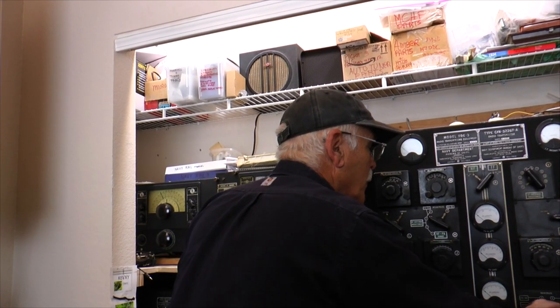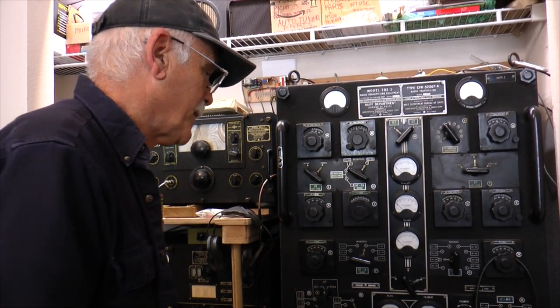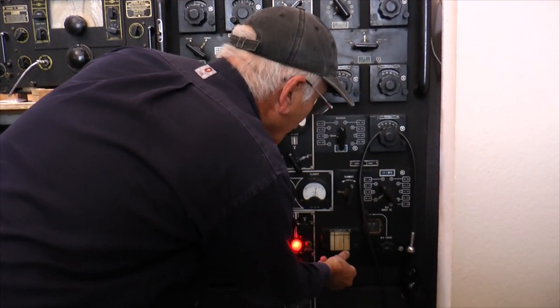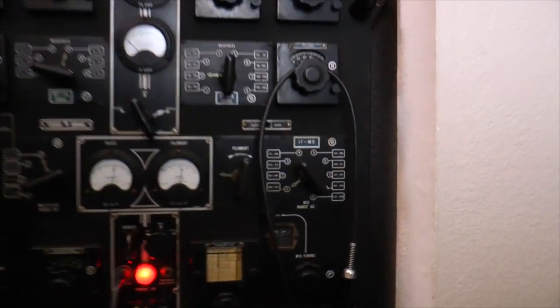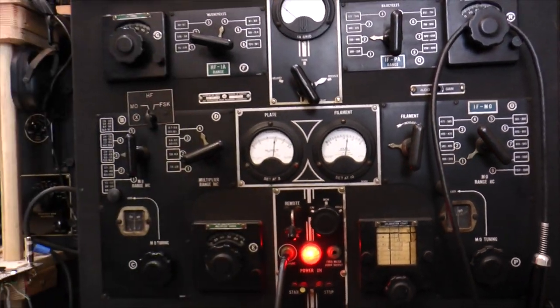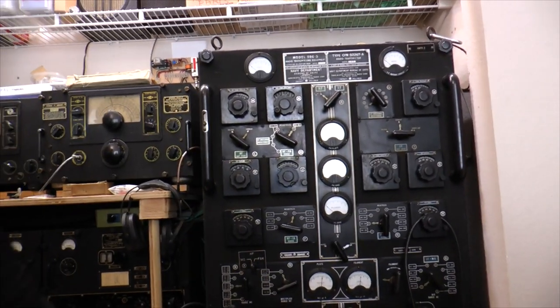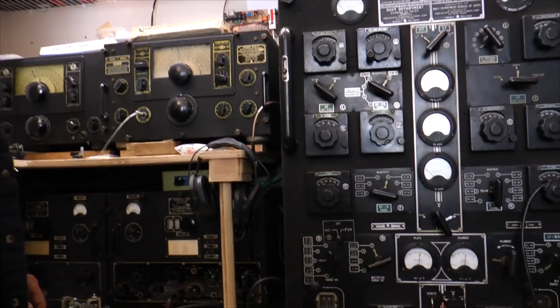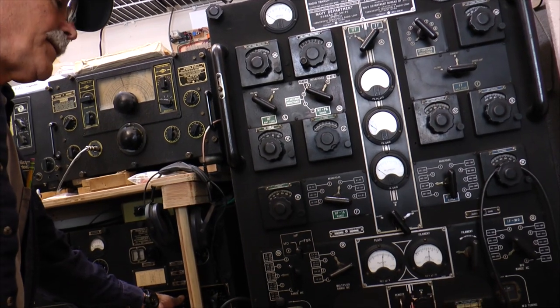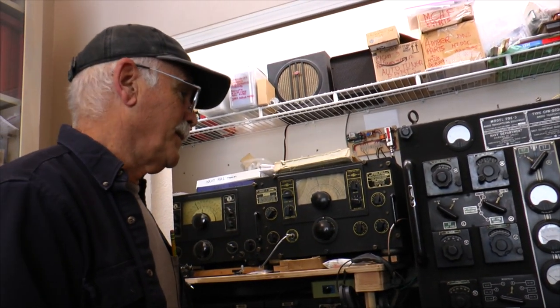But nowadays it's tough. So now we've got the low frequency side back intact, and the original logging dial here still has some of the original frequencies on it. Obviously there's no direct frequency readout, so you'd have to use the LM221 to do your spotting and correct your frequency. So you have logging dials on the RAL and on the TDE. So you kind of know, once you do it, 40 CW is going to be down here. Okay, very cool.